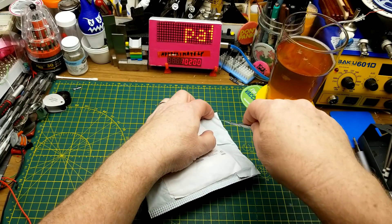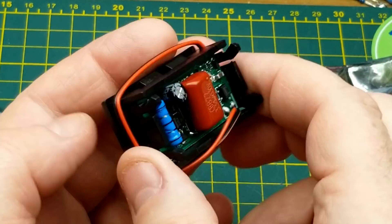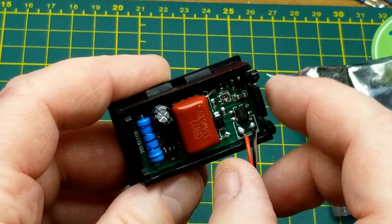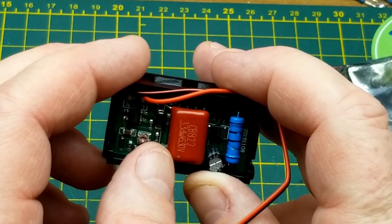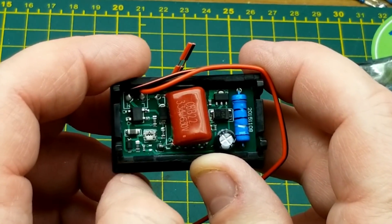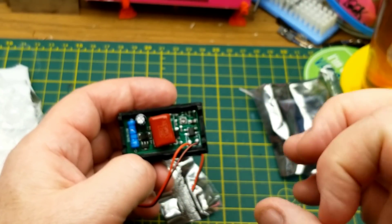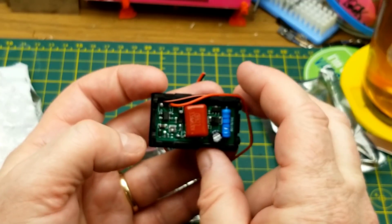Next item says it's a plastic sheet — I haven't had something that lies and tells me it's a plastic sheet for a long time. It is an LED display — probably one of those LED voltmeters. Judging by that 330 nanofarad capacitor, that is probably a little voltmeter with a capacitor dropper on it. Further evidence: the power inputs are marked live and neutral and they go straight to a full bridge rectifier. So that's probably one of the other ones I ordered when I did the video a week or two ago.